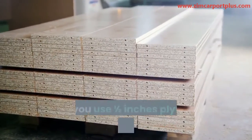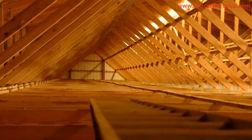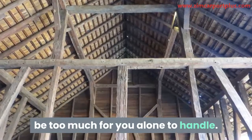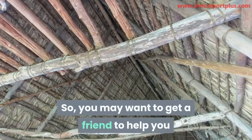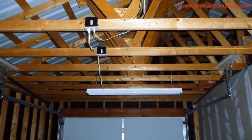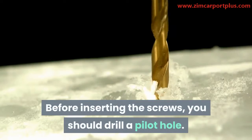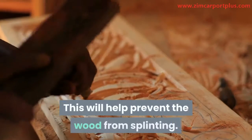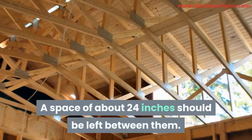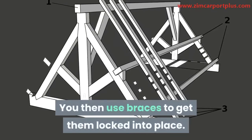We also advise that you use half-inch plywood gussets to fortify the joints. The gussets should be attached on top of the joint, then lock each of them tightly with nails. The weight and size of the trusses might be too much for you alone to handle, so you may want to get a friend to help you in fitting them with the frame of the shed. Attach the trusses to the top of the frame to give support to the beam, then lock them with screws. Before inserting the screws, you should drill a pilot hole. Place your trusses in equal space — a space of about 24 inches should be left between them. Plumb the trusses using a spirit plumb, then use braces to get them locked into place.